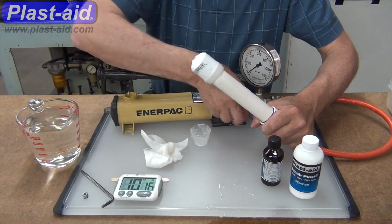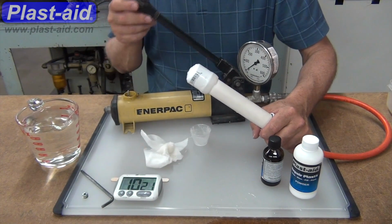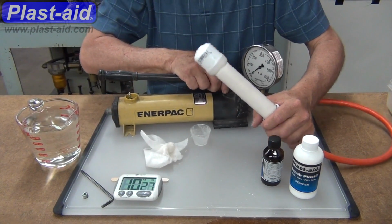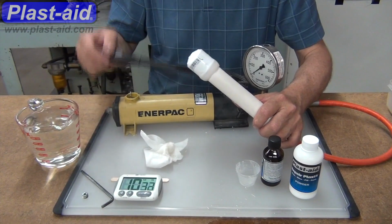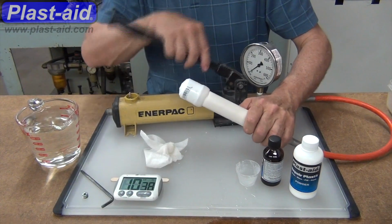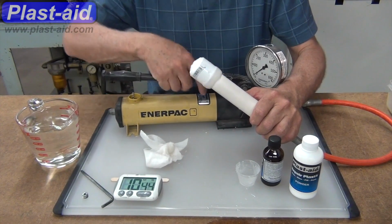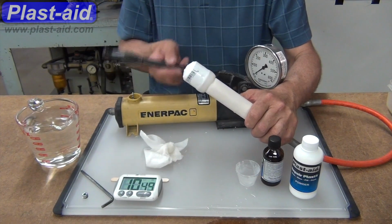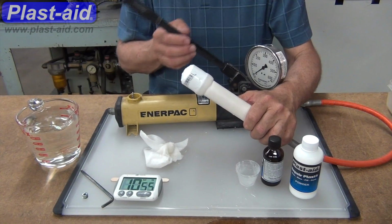Okay, right there is the knob at about 10:15. It's black, so you can't really see it, but it's sort of a thumbscrew knob that closes the valve, which allows the pump to start pressurizing. When you open up the valve, it releases the pressure. So in this case, the pump is now pumping a little bit of water at a time, filling up the pipe. There's almost no pressure on it at this point, other than what it takes to fill the pipe.